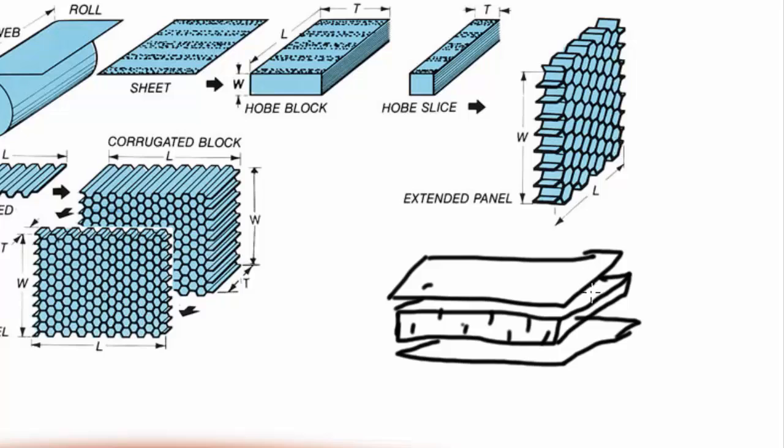Each face sheet is typically about 0.02 inches thick, since each ply is approximately 0.01 inch and Nomex panels typically use two plies per side — two sheets of fiberglass cloth bonded with structural adhesive to each face of the core. The whole assembly is then pressed in an autoclave oven and cured for at least 24 hours to produce a good quality panel.